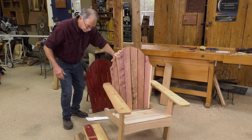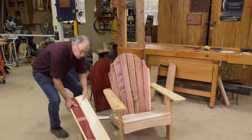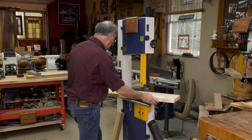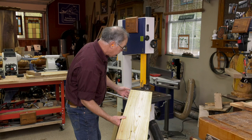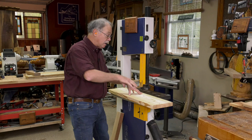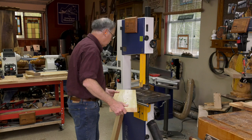Whatever you do, be sure to read, understand, and follow all the instructions that come with the tools and products you use in your wood shop. Work safely. I'll get this set up and make those curved cuts. The column is locked in place and ready to roll. I'm going to make my straight cuts first — that's a 3/8 inch, 3 TPI blade — which allows me to make good straight cuts and curved cuts on the end. I'll get both these pieces cut out. Some folks would use double-sided tape and cut them out at the same time, but it's hard to recycle wood that way. This is scrap from a construction job.